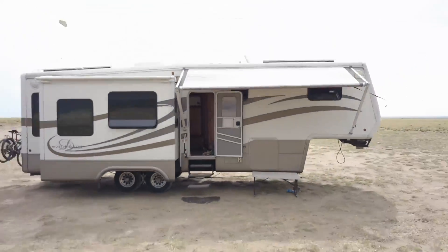Our favorite way to camp is off-grid, boondocking with no hookups. It's great for boondocking because we save so much propane. In eco mode, we can just leave it on all the time and barely sip propane at all. When we want to save water at the sink or shower, we just switch real quick to comfort mode — it heats up that little tank and we're able to save water without having to wait for it to heat up when we turn on the faucet. This enables us to stay out longer at our boondocking locations without having to go to town to fill up water or propane. The beauty of an on-demand water heater is that we only use what we need. Previously with our tank water heater, we felt like we needed to use it all, so we'd save all our dishes and showers to do them all at the same time. Now we do the dishes when they're dirty and take showers when we want to.